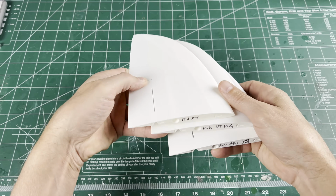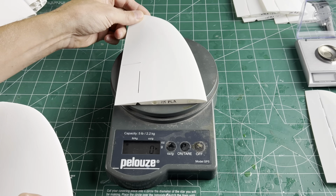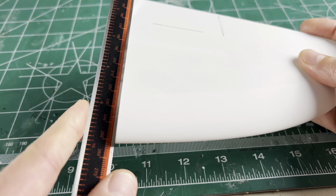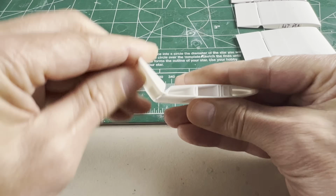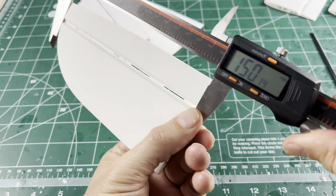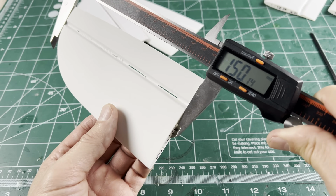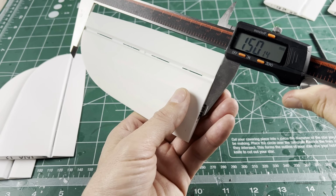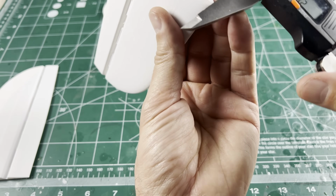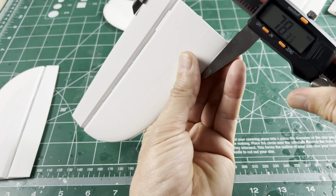Looking at print quality between the different materials, I can compare dimensional accuracy, weight, surface quality, bridging, warping, and in my parts, the hinge area. So dimensionally, all the parts, as printed, look the same. All are within 1/10 of a millimeter of each other, which is pretty good. No shrinkage on the large dimensions, X, Y, and Z. But we can remeasure this after the heat test.